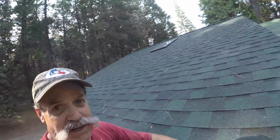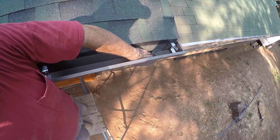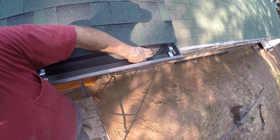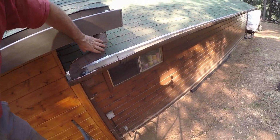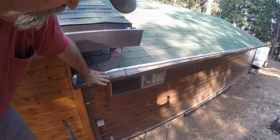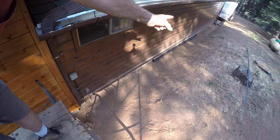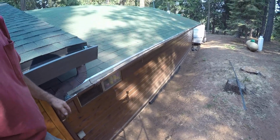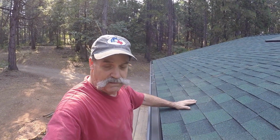But yeah, all in. And I use a 1/4 inch hardware cloth, just rolled up, and that catches most of the debris, and if it fills up too much, it will just overflow. That works really well with pine needles and stuff. And then here's a little temporary, and might be permanent. We'll see how this works out. It just drains into this other gutter. I got this back in, downspout down there, and then we'll have a drain pipe in here to carry all the water away. So that's the gutters. Went pretty quick and easy. We'll move on to the next project.